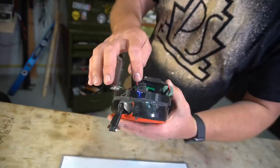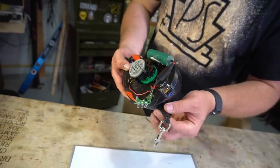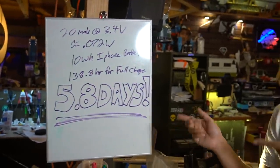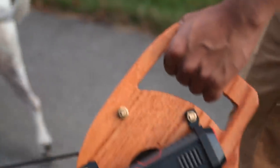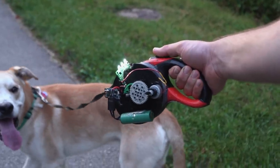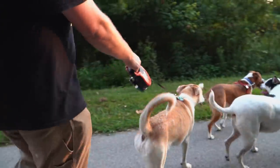Luckily we can plug it into the wall and just use this as a normal power bank — well, not quite normal. As you can see, the math is pretty terrible: 5.8 days of running your dogs around. Unfortunately, this wasn't really enough current and power output to really charge your phones. There are just too many inefficiencies and losses in the system to utilize the dogs in the most optimal way. However, using the in-and-out motion of your dog leash, you generally put out enough current and voltage to run some simple LED lights and small electronic devices. But it was an interesting experiment.